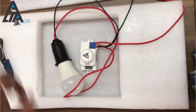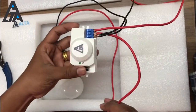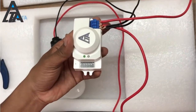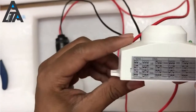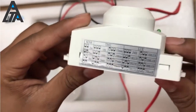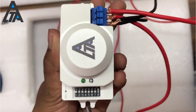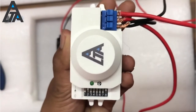There are eight analog buttons given — 0 and 1 — on which you can control different parameters: sensing distance, time, and lux. The first two buttons, one and two, are for distance, ranging from 2 meters to 10 meters of detection range.